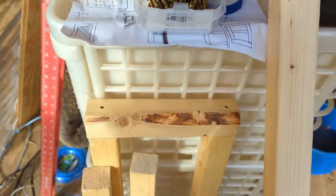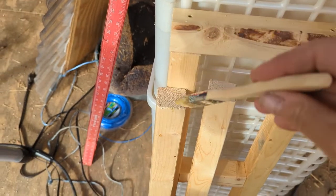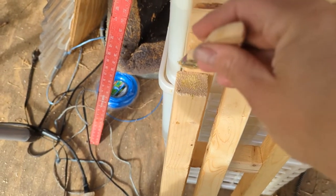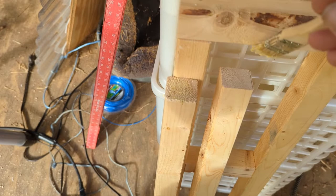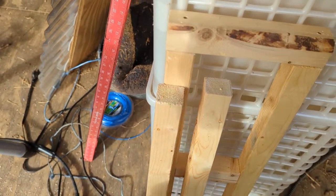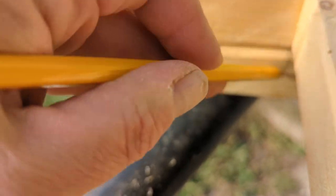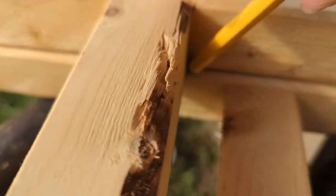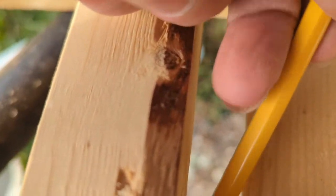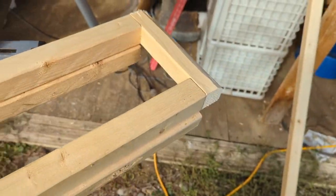So I'm just going to pop some glue on top here and then screw them in. I have some trim head screws here so they won't show very much, although it won't matter because a lot of this is going to be hidden either underneath or on top. I'm going to screw the top in and then I'll screw the bottom in. I'm just marking where the placement is so they're equal — or equal-ish — so they won't be obvious if they're different. Then I'll screw this in and do the bottom after that.